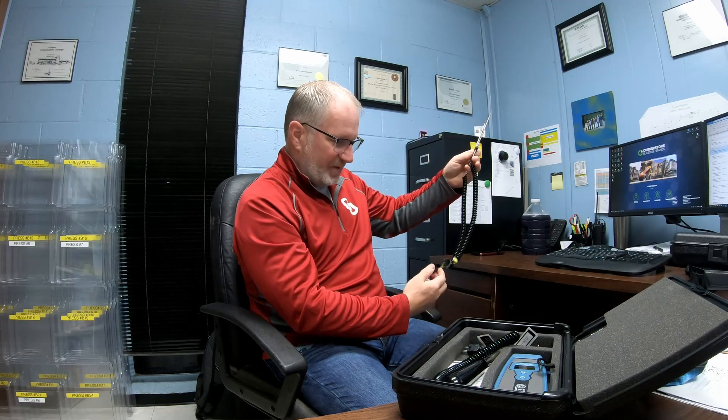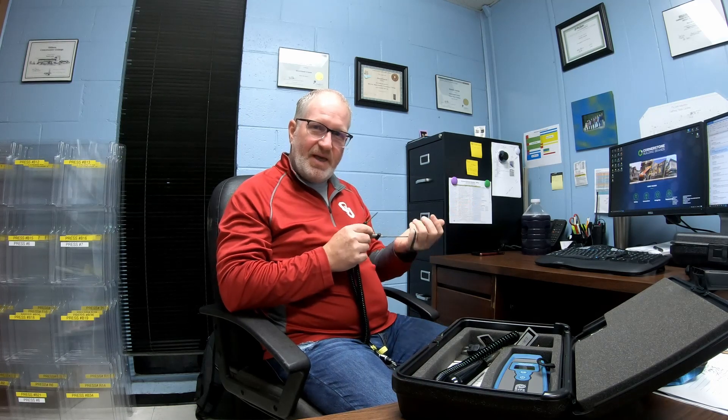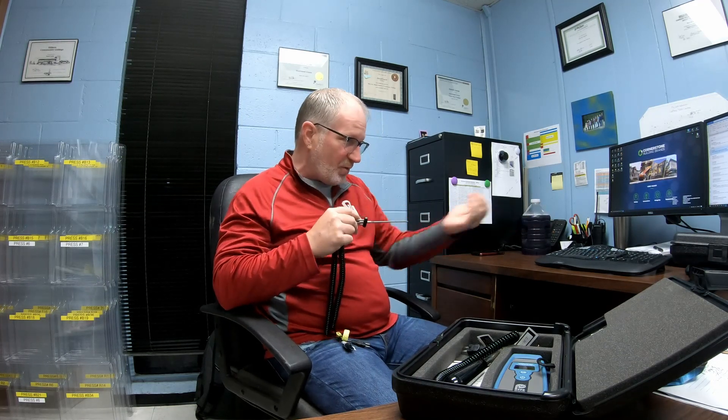This is a newer unit. You have different types of needles — a hard needle and a flimsy needle — and one responds faster than the other. What you do is purge your material out, grab it with your heat glove — you can purge onto cardboard or something to get a hold of it easier — stick your pyrometer probe in there and keep moving it around, taking the highest reading. Do that three to five times and average the results. Write down your readings each time to get an accurate melt temperature.